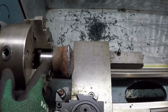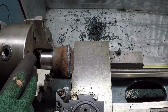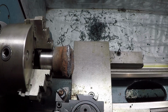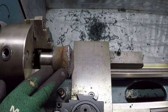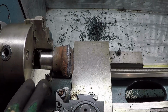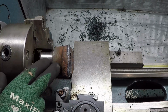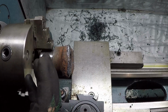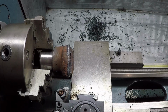I removed the welding spatter and I cleaned this with sandpaper, and I cleaned the lathe chuck. Then I chucked this part on the lathe. It's running true. The weld looks great. I have no porosity. After I welded it yesterday, I heated it with the torch. Then I set it inside ash so it will cool slowly, and this minimizes the weld stress on this part.